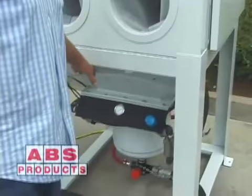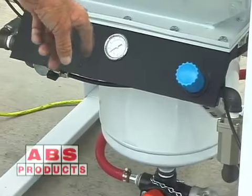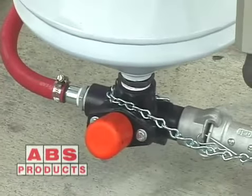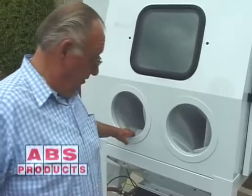Our dashboard is right down here where you can see the pressure. You can regulate the pressure here — we use a micro valve down on the bottom where you can regulate the media. You can run plastic, steel shot — you can damn near run marbles. Right now we've got number six glass bead running.